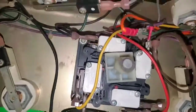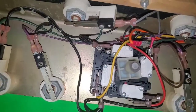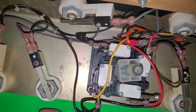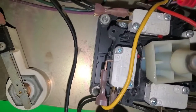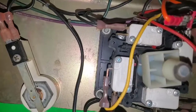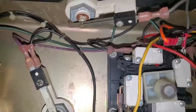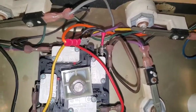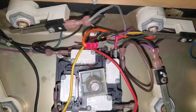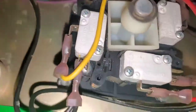Let's just turn this joystick upside down. Basically, here's the way it works. If I move this up, I'm hitting this button right here. This is the push-button type micro switch. Usually has a big plastic ball or a square, and when you push that, it hits the buttons. See where I push it to what would be my left? It hits that button, and it's reversed because when you look at it on top, you're moving it to the right. So that would be left, and the right would be over here. The up would be down — the down would be up because you've got to look at it this way. When I push this down, it's hitting on the up button.